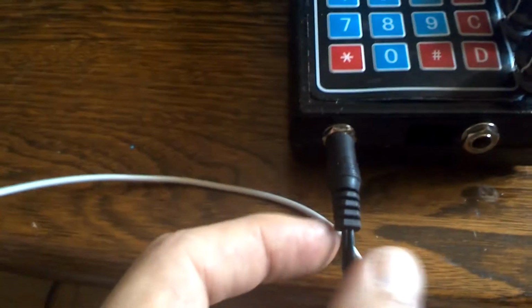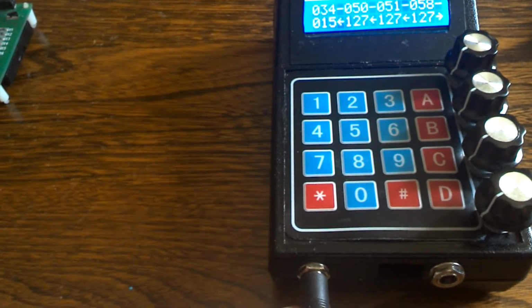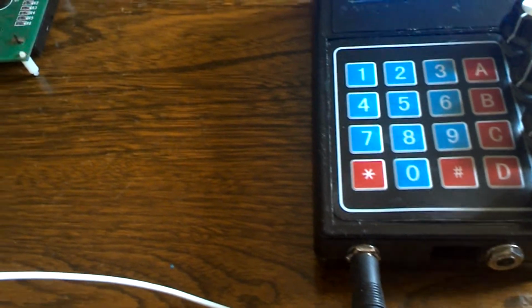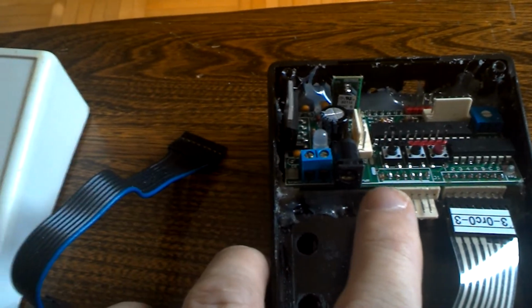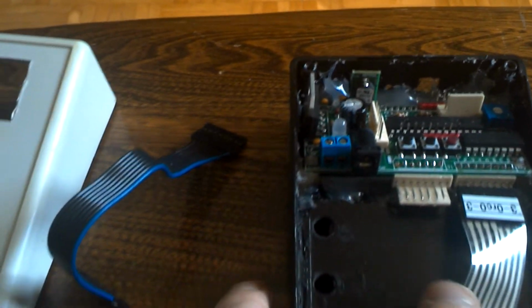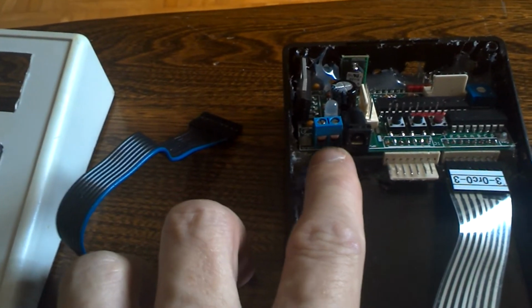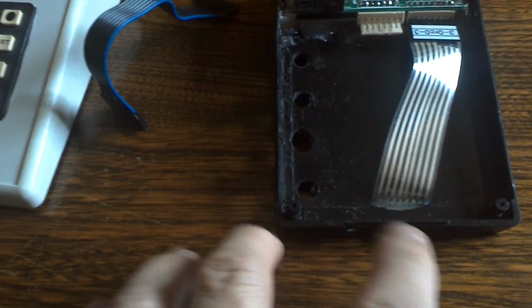And the way I wired this up is this is the power supply to run it. It's a 12-volt power supply, 1 amp, and then the track, you'll connect it to this. Again, you can connect it any way you want. In this case, the way I'm doing it inside is, this is the power connector. I'm actually bringing it down to the bottom of the case, and then you extend it there. And then this is the track connector with the 2 screws. You just pass the wires in, and you can put them down to the bottom of the case and attach whatever type of connector you want. Again, cut the board off, have one at the layout, one not.